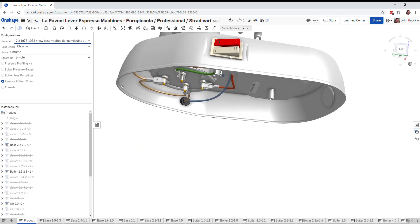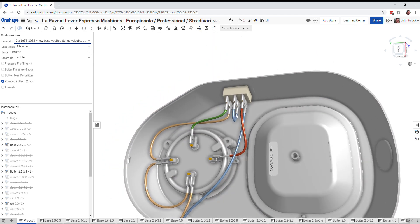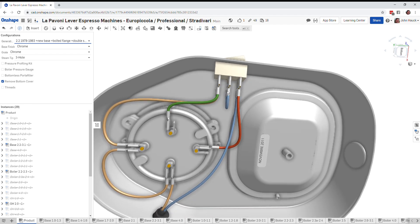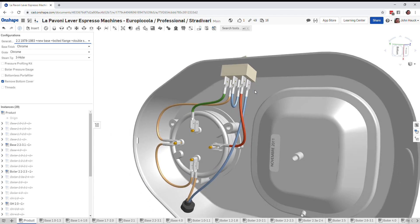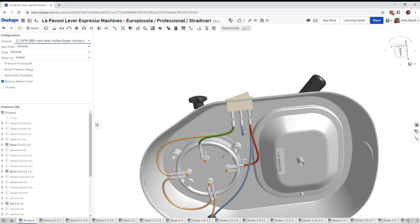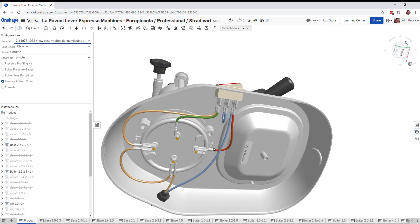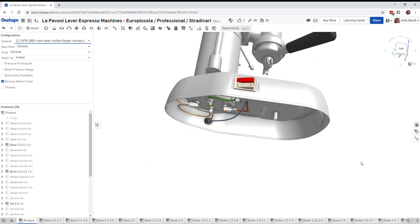They've created a separate on/off switch and a low/high switch. The on/off switch takes the blue wire and, when turned on, runs power up to the A/B low/high switch. The blue wire then runs power either to the red wire or the green wire — same complaint again: 300 or 700 watts, you don't get 1000 watts. But you can see what they're doing here over the ages.